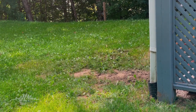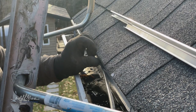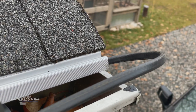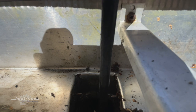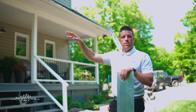Just to give you an example: the edge cutter will go under the leading edge. The heating cable will start on the left-hand side, run under the edge cutter along the entire leading edge, drop down into the gutter, run back through the gutter, and then down the downspout and out into the drain. So we want to make sure we know where our power connection is going to go.